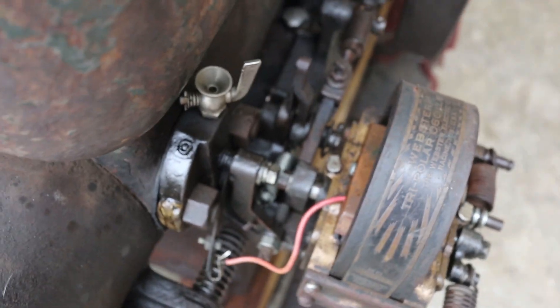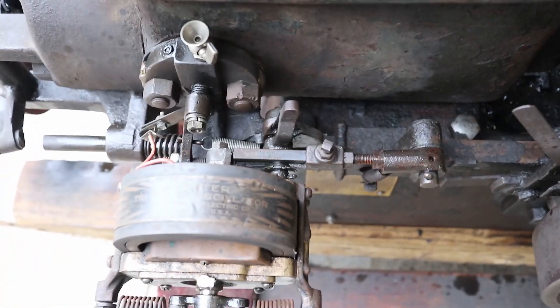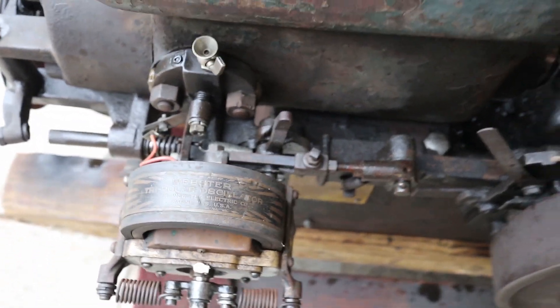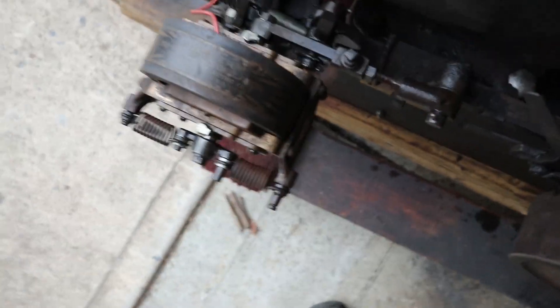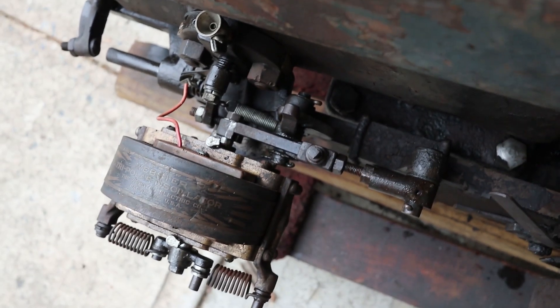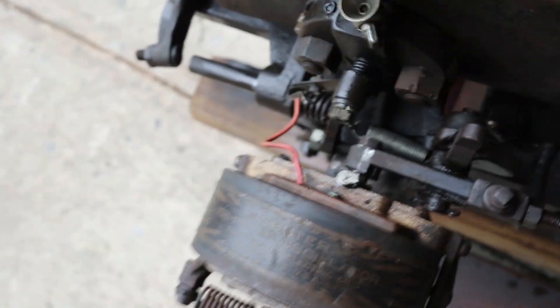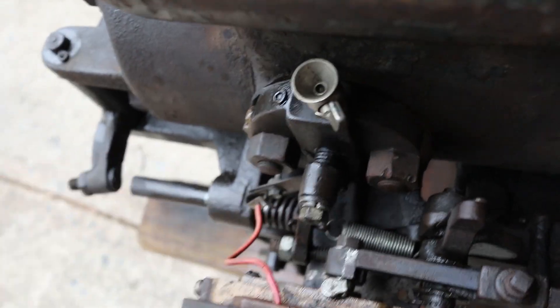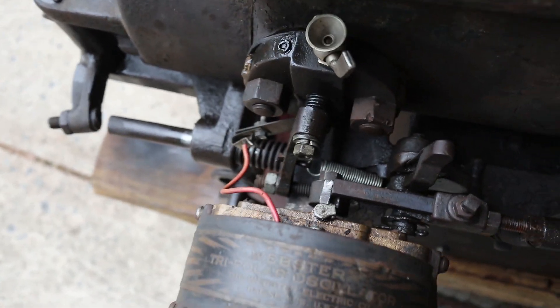It's just mildly warm to the touch around the cylinder here. This little bar that actuates the magneto pushes a little lever on the back of the magneto — it actually does two things kind of at once. It pushes the magneto. When it gets to the point where it's ready to fire, it's going to push it forward. And there's also a set of points inside the igniter, and that point set will open up on the rebound of the magneto stroke.